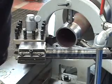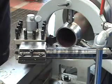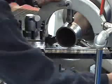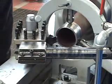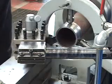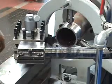One thing I'm concerned about is chips falling into the rollers of my steady rest, because it will leave a horrible mark. That's why I set up with the rollers all the way back. This one's not rolling so I'm just going to tighten it up a bit to make sure there's even pressure. I'm almost done here — nice smooth finish. I'll take one bit more as there are still some saw marks on the other side.